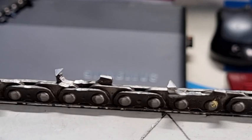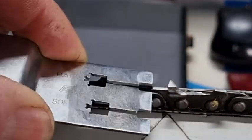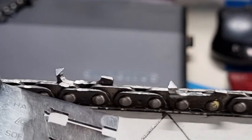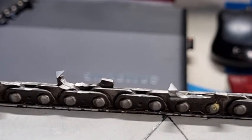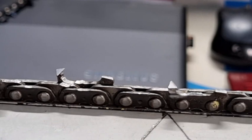Now you hear people turn around and say, oh, they're not meant to run the file over. Well, I can tell you right now that if you want to sharpen your chain, and you're putting the depth gauge on there, I only put the depth gauge on once and I run the file over once. If you're putting it off, on, you're going to take 3 times longer to file your chains. It's as simple as that. So, yes, all the professionals will keep this type of gauge on top and file straight over the top. You can do some YouTube searches on progressive depth gauges. Everyone will do that. All the professionals are doing it that way. So if you're putting it on, taking it off, putting on, taking it off, you haven't learned how to file chains properly. Simple as that.